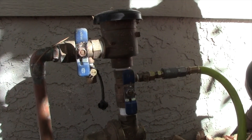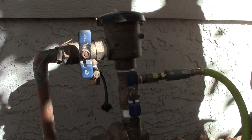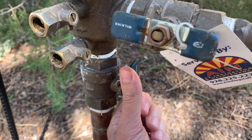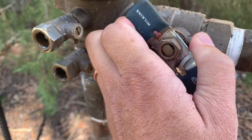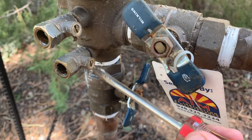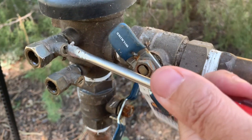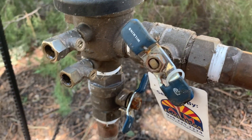To finish it off, we'll turn the ball valves a quarter turn and leave the test cocks open. Some people like to do a quarter turn on the test cocks — I like to leave them fully open because it's such a small valve that I just want to make sure it's open. If your isolation valve is leaking, it'll fill up the main line and then come out that first test cock, which will save you a very expensive repair in the spring, or maybe even the winter, depending on how bad the leak is.